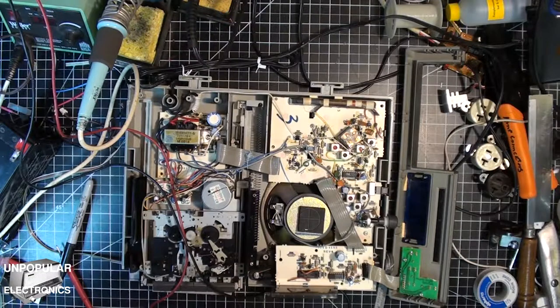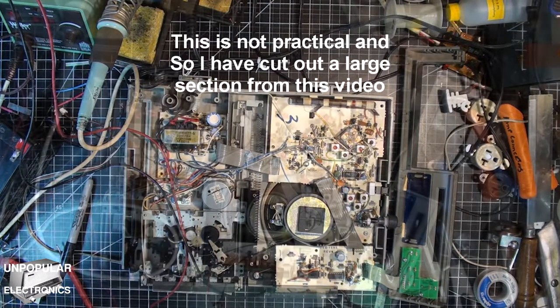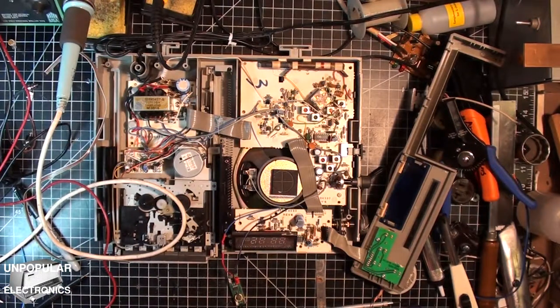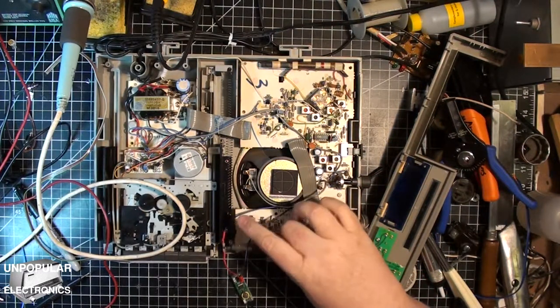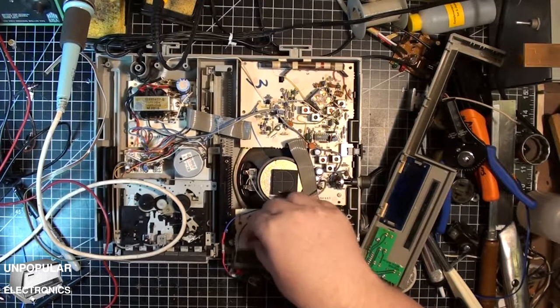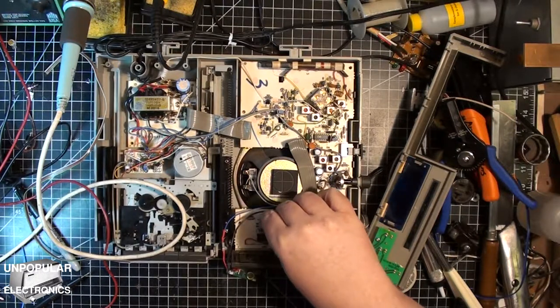The fun part about all this is that I want to power down the vacuum fluorescent display so it's not running unnecessarily. It took me a while to figure this out. I had to completely reverse everything I did — when I took this chip out of the circuit, something in here started oscillating and there was a loud constant tone that came out of the speaker.